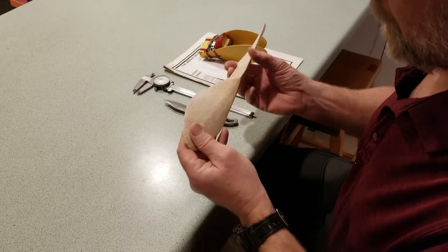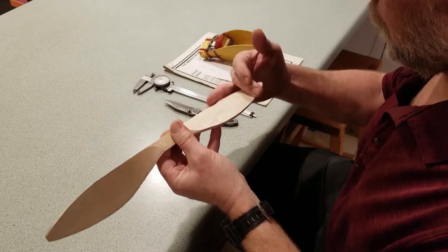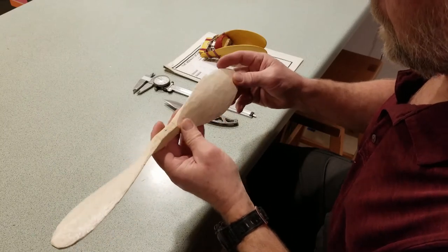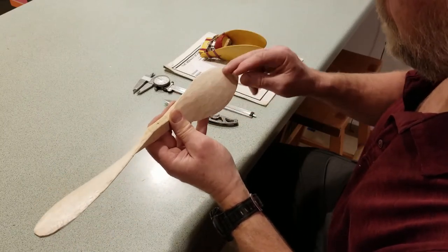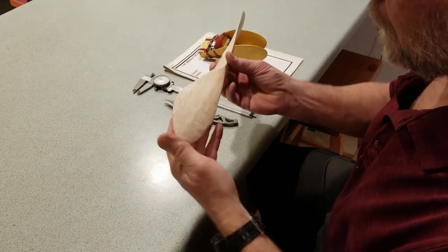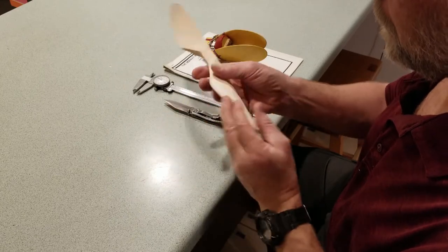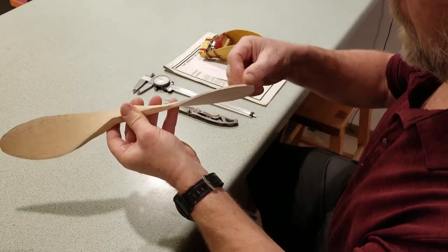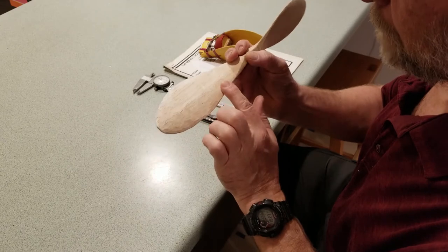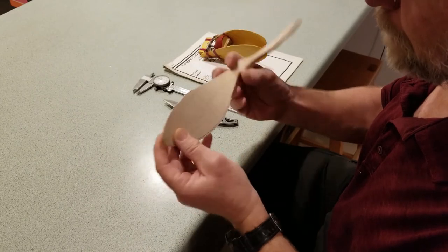At this point, I am done with the knife. Can't risk going any closer with a knife and gouging in and going too far. I've been using the shadow from the high point to get it uniform, taper down to the trailing edge and this radius up from the leading edge. So that works for this also. I took this to within less than an eighth of an inch on the trailing edge, and the leading edge went down as far as I can and still leave enough material for a radius.